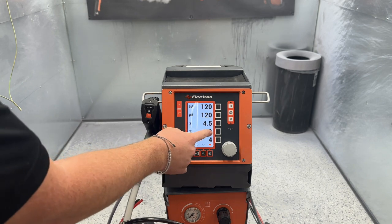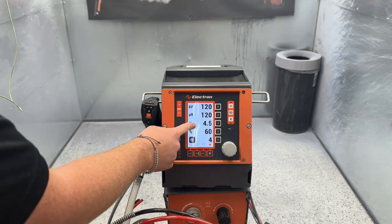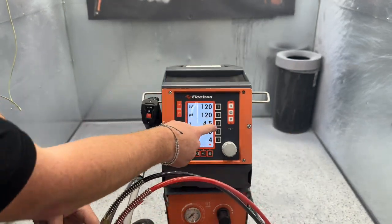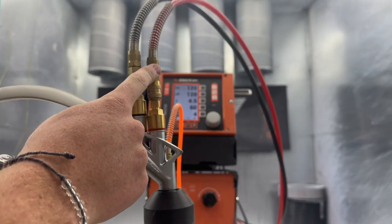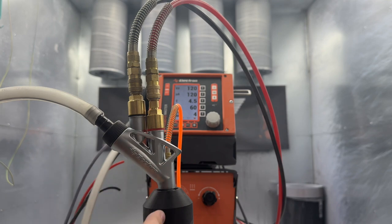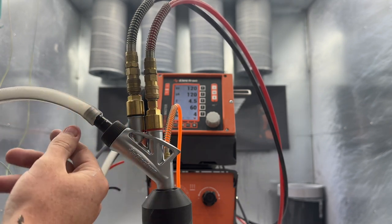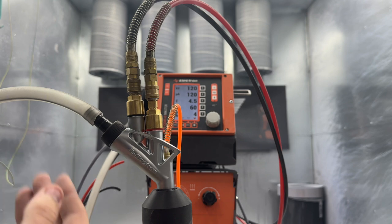Next, we have our two air controls. We have our 4.5 and 60. This is your total air, and this is your transfer air. There's 4.5 cubic meters per hour of air through both of these lines at all times, and 60 represents 60% of that air is directly in this red line. So 60% of that 4.5 is going through this — it's going to come inside this pump, make a hard 90-degree turn, and blow back this way. That's what creates the suction to pull up the powder from your pickup tube or hopper. The remaining 40% is going to be in this black line, going in here and blowing this way — that's an assist air to help the powder go through your powder hose and come out of your gun at a nice, consistent flow.